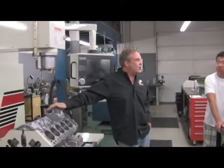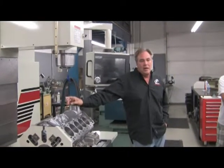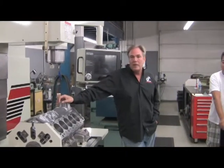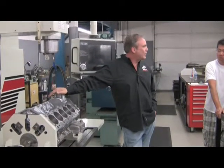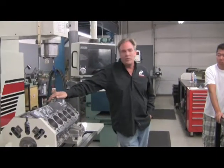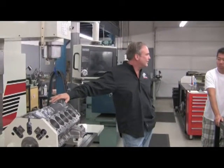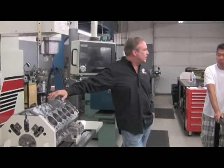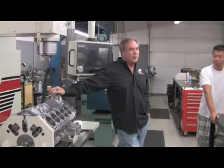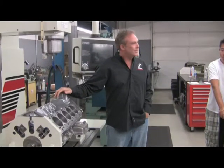The process is written by Schmidt, who's a supplier to BMW and all the German car companies. The pistons were perfected by Mahle. The aluminum is actually American. I think it's Reynolds. It's an American product that they sold to the Germans because the Americans wouldn't pay the money for the material because it costs more than regular aluminum. They didn't want to spend $20 more a block, so GM puts a steel sleeve inside it, and so does Ford. But the Germans go, wow, lower friction, better sealing, it's only $20?